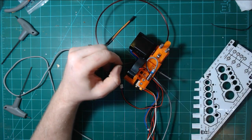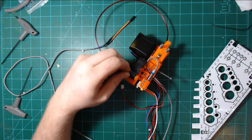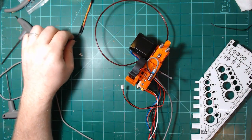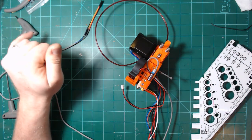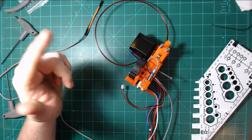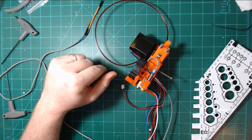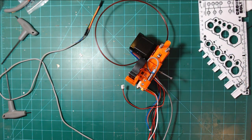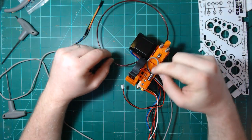So, Rob Nisters, you read somewhere that the Pinda probe has a bad temperature drift, and that's why there is a temperature sensor inside. The new V2s definitely come with 4 wires, and they have a thermistor wire. We can't use that with any of our boards. I think you need that special Einsy Rambo, or whatever board they use for the Mark III. The Mark IIIs come with the V2 version of that probe.